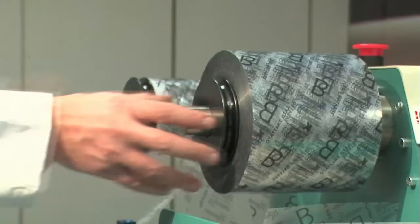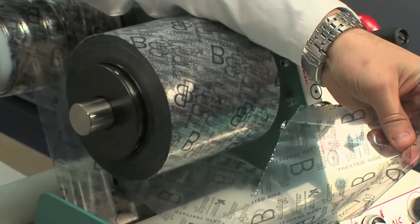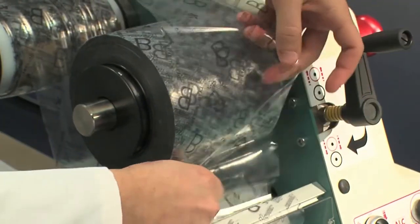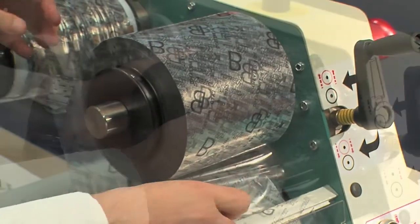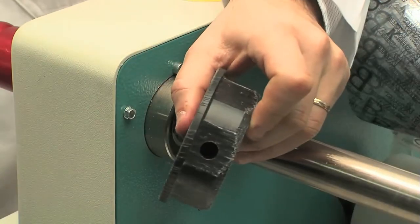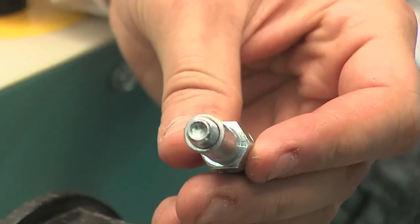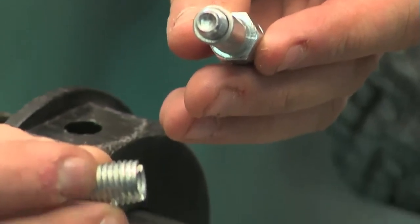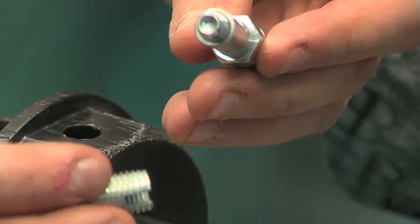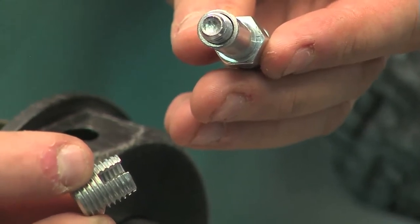Repairing the black chucks. Remove the external chuck, then cut the adhesive or polythene film and remove the roll. Now the internal chuck — the one with the fault — can be accessed. Follow the repair instructions provided to make the necessary holes: hole diameter 10.5mm and depth 15mm.